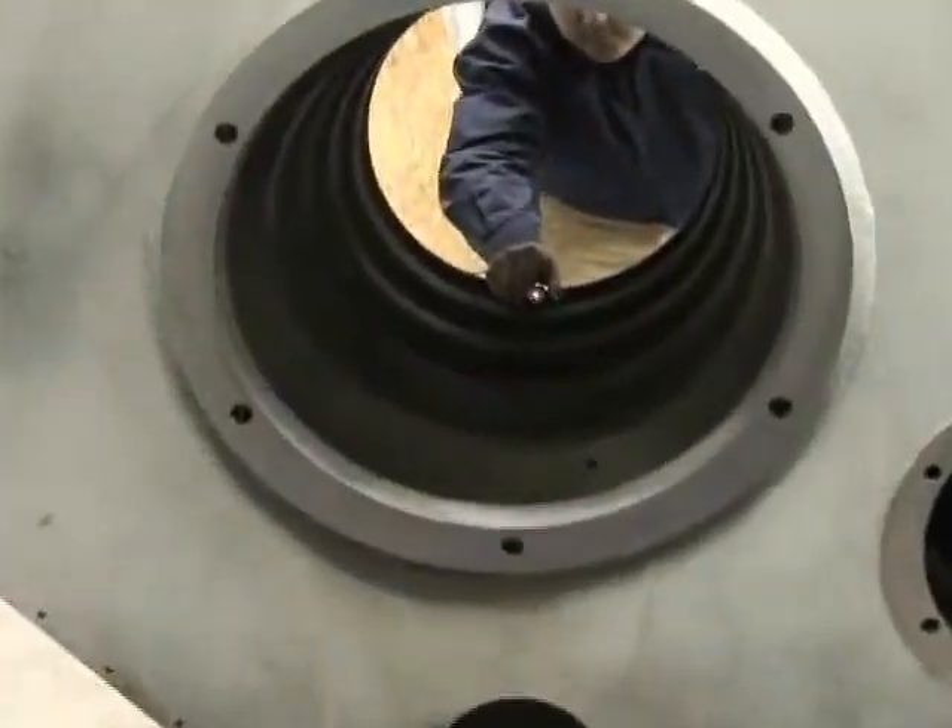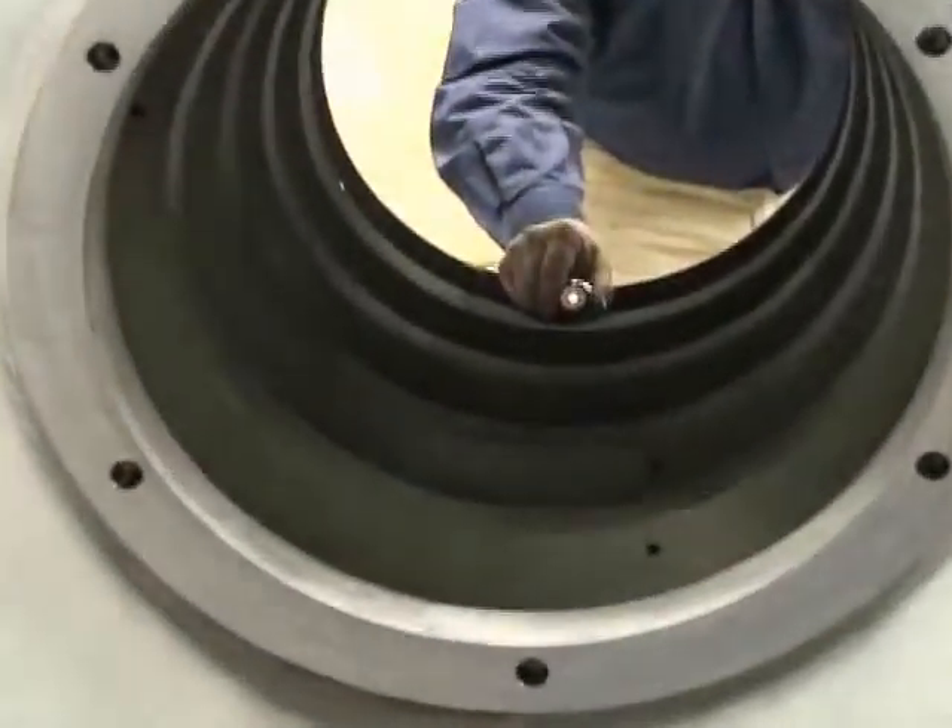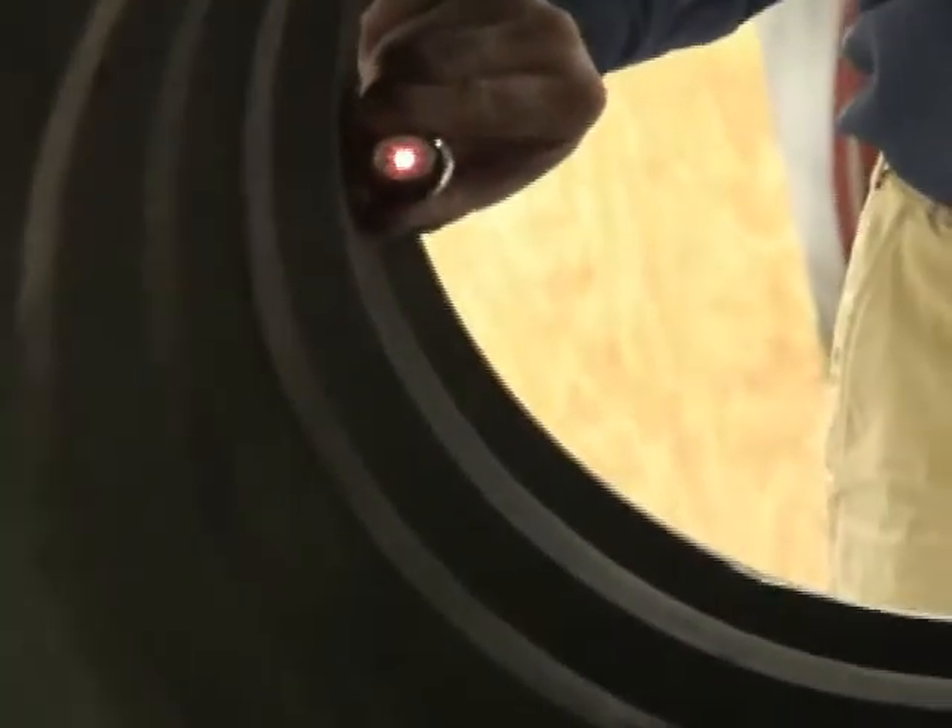Right now we're measuring the main bearings — simply following the SMR along the edge of the profile, collecting the data to determine the diameter and also to find the center line.